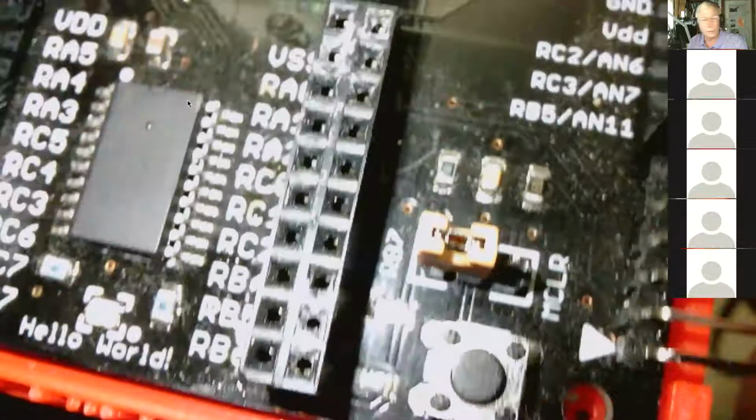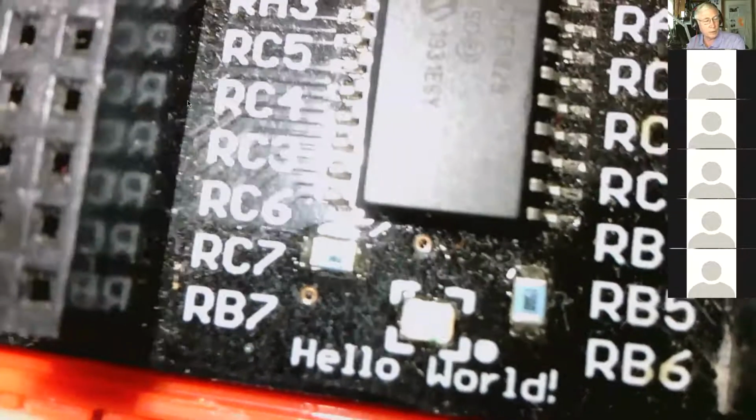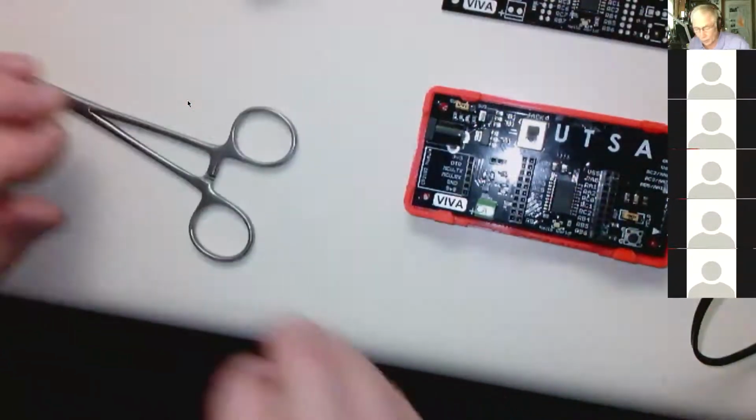And then we have 2 resistors and a cap over here. We have a couple of despiking caps here for the chip right there, and then we have 3 current limiting resistors for the Hello World LED, and it's RGB, and it's permanently connected to 3 of the pins, but it doesn't really matter because it doesn't take much power, so that's fine.